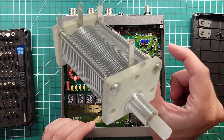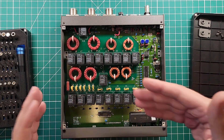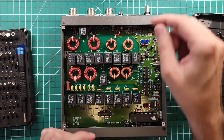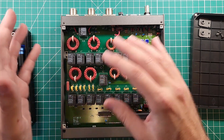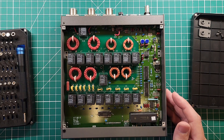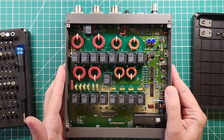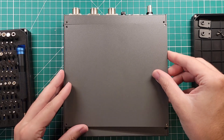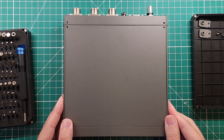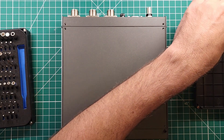This is the same thing you're doing with a manual tuner where you tune the big knob — that chunk-chunk-chunk sound — which changes taps on a large coil inductor. The other knobs are variable capacitors, dialing in different amounts of capacitance. To do that automatically you'd need a stepper motor, a variable capacitor, and a sensor, or you can just switch individual capacitors on and off and take measurements as you go. This is extremely clean and extremely well done. Let me get the top back on and take the bottom off.